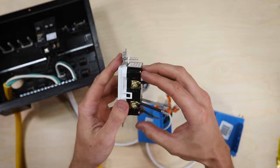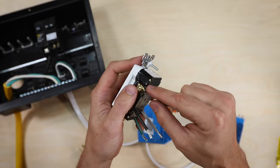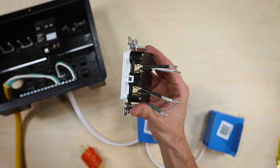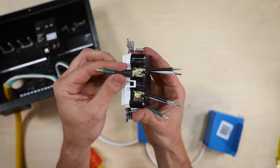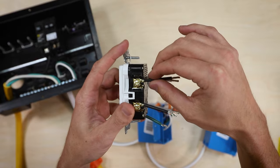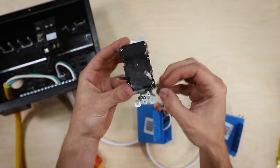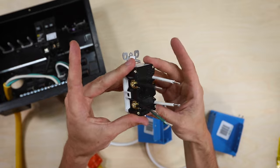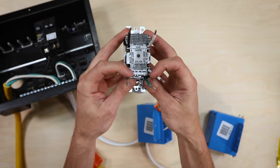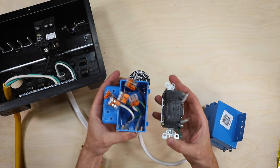Now I have all my pigtails attached. This particular GFCI has little plates underneath the screws that we're able to put the wires right underneath, so since it has this compression plate we don't have to and can't use the fork connectors as they won't fit — but since this plate prevents any breaking of these strands of wires, that's fine. We have our hot, neutral, and ground wires attached to each side of this GFCI outlet — the line wires up here and the load down here.